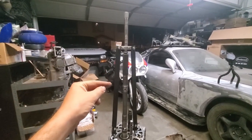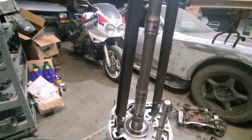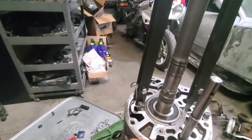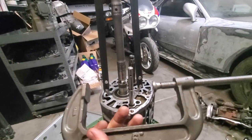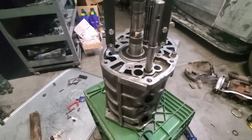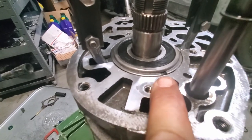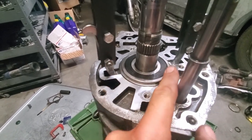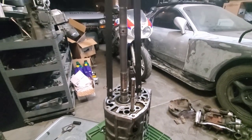You can see the custom extensions I made on this puller - I drilled holes on the top of four bars to make two sides per arm. This bolt right here is blocking the clamp from swinging through like a pendulum so you can actually lock onto it. I'll use this C-clamp to hold it together so it doesn't pull apart when I put tension on it. Also important: rotate the C-clip opening 90 degrees away from the openings so you're not grabbing right on the edge and pulling the C-clip off the bearing.